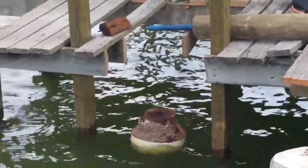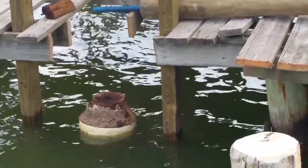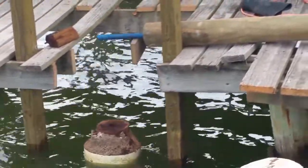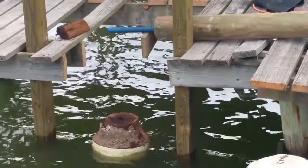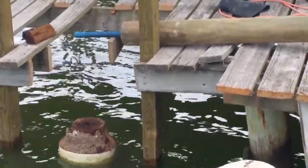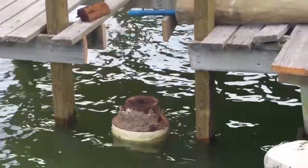I've been prepping that piling there for repair. I've got it cut off and bored out roughly 14 inches. The bolts I'm using are inch-and-a-quarter Teflon-coated bolts, 28 inches long, so I sank it 14 inches into the repair piling and then drilled down into the original piling 14 inches.